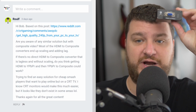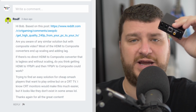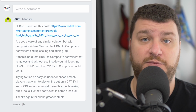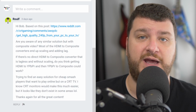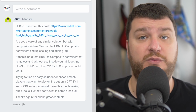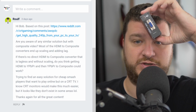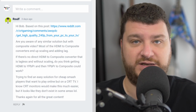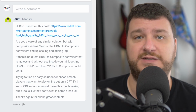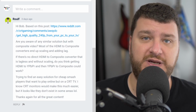I have not tried it with this, but it should work. I can't think of any reason why it wouldn't. Of course, you could just use an HDMI to component video converter if you have that, or get an arcade VGA card, which you could set to always output in 240p. And then something like this most certainly would work, because then you're just doing VGA to composite. So it's a pretty cool idea. Any kind of basic signal conversion like that should always be zero lag, so you shouldn't have to worry about that.